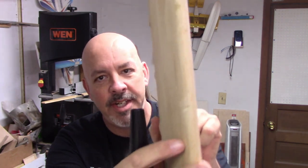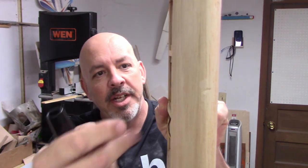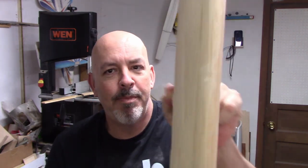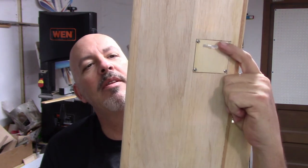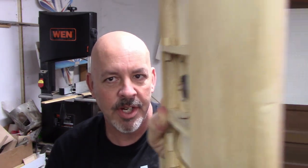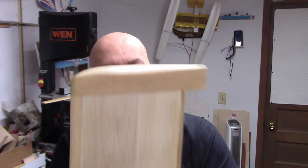What I did was the old-fashioned method, because it's balsa with the compression. I injected some water into it and then hit it with a heat gun and expanded it, probably brought it about 75% out from how much it was pushed in. So it's dry now, so I'm just going to go ahead and put some filler on there and let that dry. It's going to take a couple hours for it to set up, and then I'll probably do a final sanding on it.